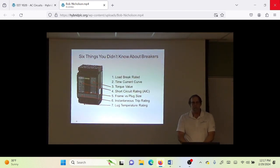If this is not rated, it'll explode. So you can buy this breaker that's rated for 5,000, 15,000, 30,000, 40,000, 60,000. Guess what? As that number goes up, so does the cost. So what do people go out and do? They buy the cheap one. If they don't know what they're doing, and they put this in the circuit, and this breaker tries to clear the fault, it will explode. It's not rated to clear the fault.